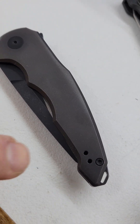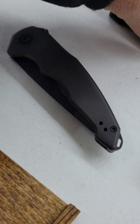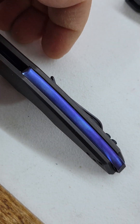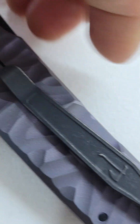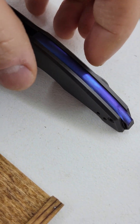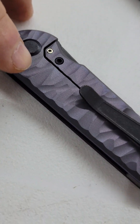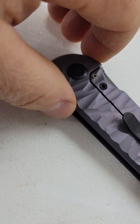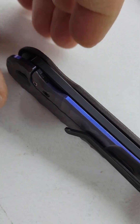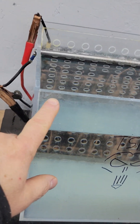There's a lot of testing involved. You can see some of these customs here — this is black anodizing. Moving over here, this is a polished finish and it's a very bluish purple, hit at around 24 volts. This next one is a ceramic bead blast at the same voltage and same time in the tank — and you get a deep purple instead. On the polished edges it's a little more blue and vibrant. So your finish on the part before you stick it in the tank is critical for the color you're trying to achieve.